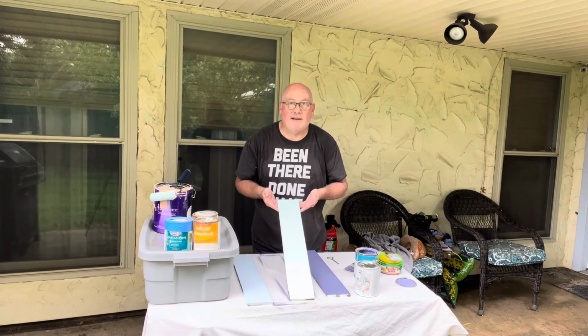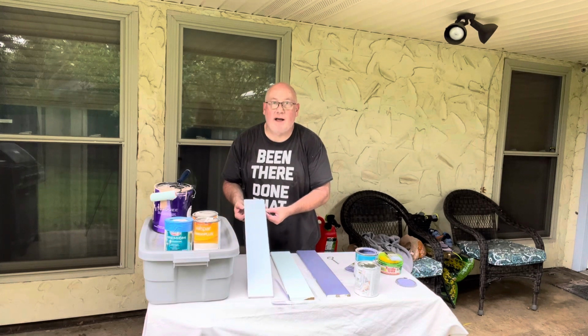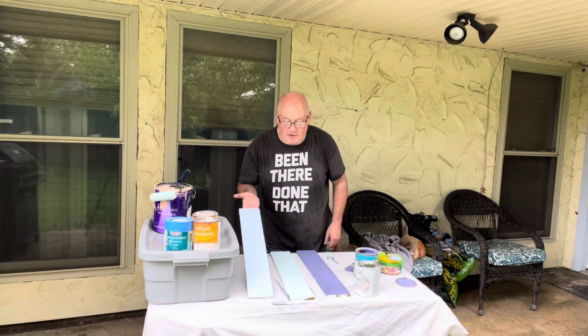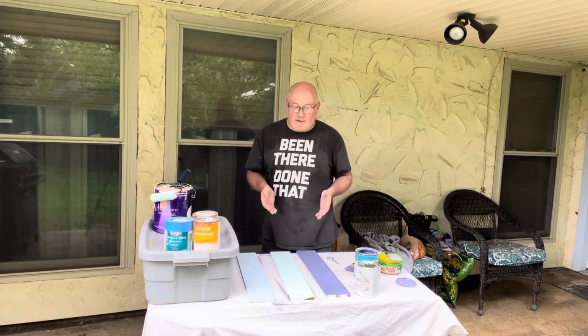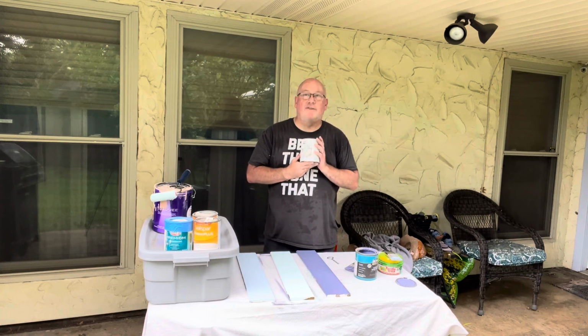It's going to look absolutely fantastic every time. And I didn't even apply second and third coats. I mean, wow, look at those. They're just gorgeous. So that is how to prepare surfaces that are already stained, even really old ones, like these 1960s cabinet shelves. If you're going to paint something expensive and really old and stained, you're going to want to put some Zinsser primer on first.